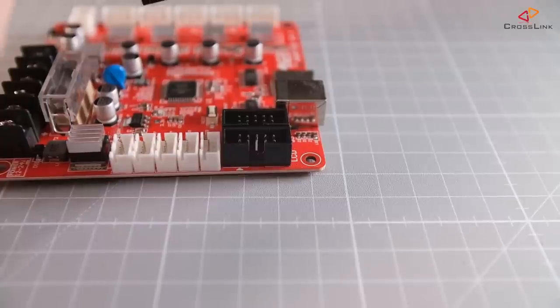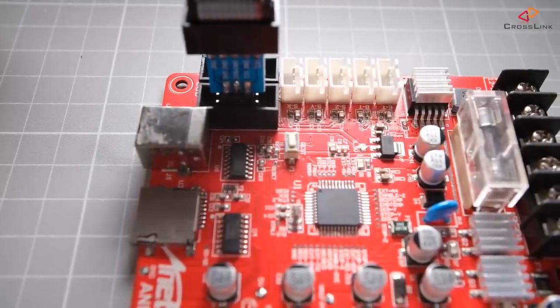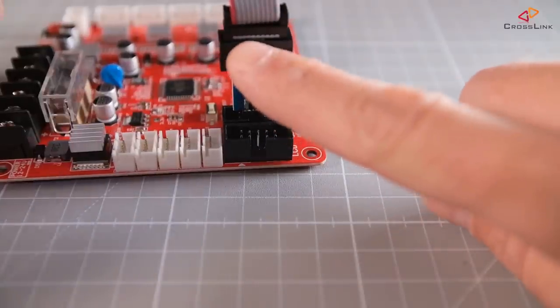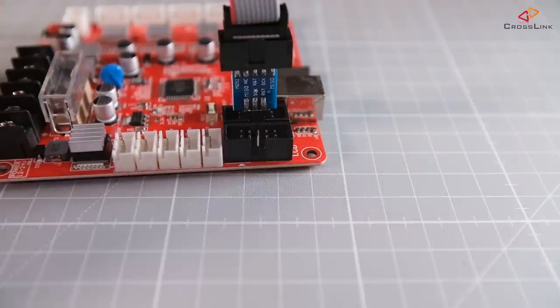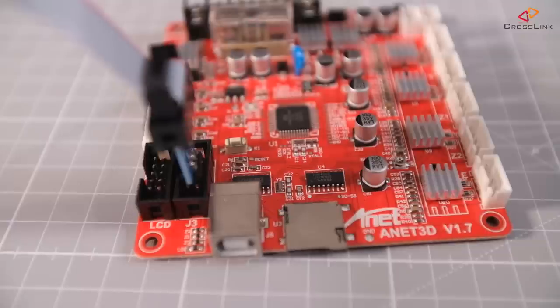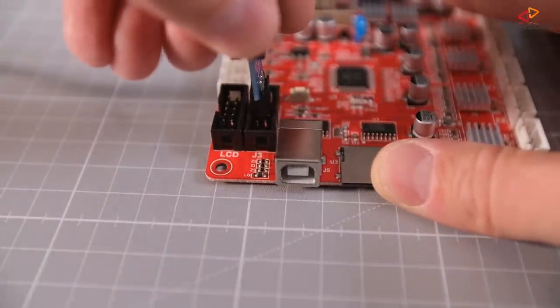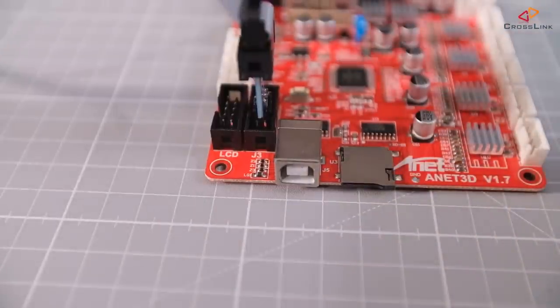Now you are ready to connect your board to the programmer, but please turn on the printer's power if you are doing this while all the motors and fans are connected to the mainboard — otherwise those will be powered from the USB port, which might overload your programmer or USB port. For the Anet A8, plug the adapter into the middle three pins of the J3 connector, with two pins visible on each side, and the connector's open slot at the 10-pin side facing towards the LCD connector. On the Ender 3, plug the adapter into the 6-pin ISP connector next to the display connector. A flashing LED on the board indicates you connected the programmer correctly. Don't worry if the cable is in the wrong direction — you'll get an error while flashing and can simply turn the adapter around without breaking the board.